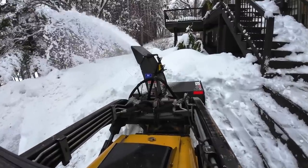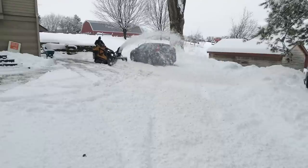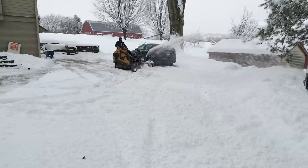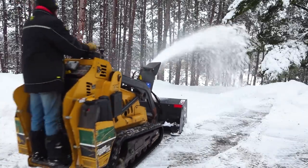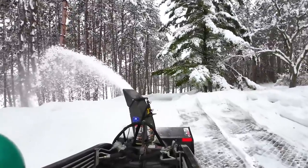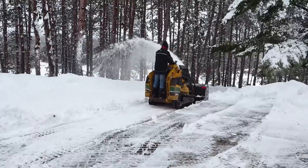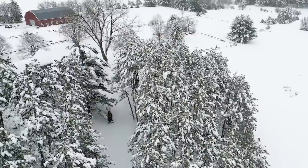It's not something that I would have had time for anyway before the winter hit. The trench for that would be much more serious than that dinky little temporary power trench that I put in. Our frost line here is 42 inches. The water line has to be well beneath that, unless it's insulated or something. So it's a big trench just to get those services out here. So anyway, it's just a future item, and for me it's not that big of a deal to just walk to the house if I need to.